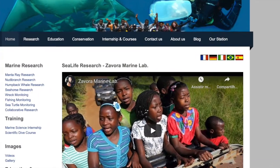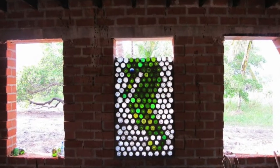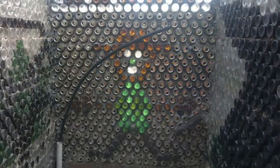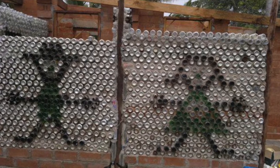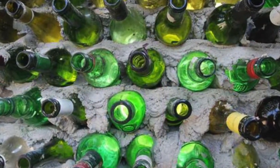Hello everyone, I'm Yara Tibirissá and some years ago I built a field lab in Mozambique using sustainable building techniques with the help of the architect Andrea Gross. In this video I show how to make the bottle walls. In 2013 I started to build the Zavro Marine Lab. The main structure walls were made out of low cement bricks made from red sand. The non-structural parts were made out of mainly glass bottles and in some cases also cans that we used in the showers. Here I'm going to share with you how I prepared the glass bottles and I hope one day you make your own.